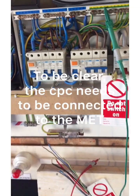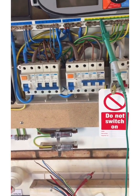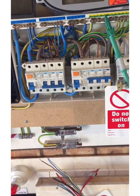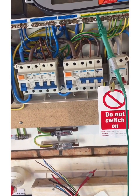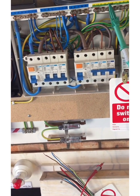So that was day one. We've had the lights wired, we've tested them, we've connected them in. Day two, we second fixed everything else and we've come to the point where we're going to do — well, we've done continuity protected conductors, those who would have done that up front first — ring continuity, and now we're on to the insulation resistance test.